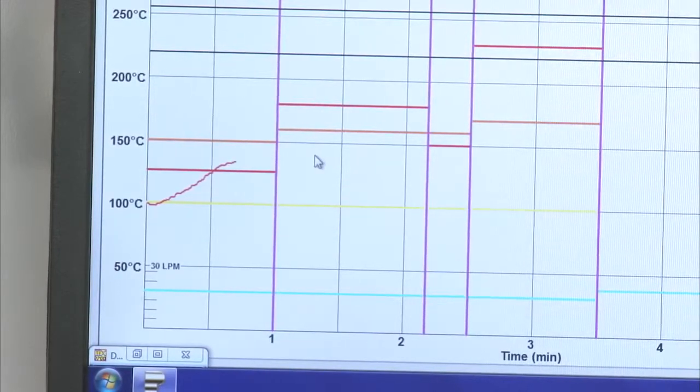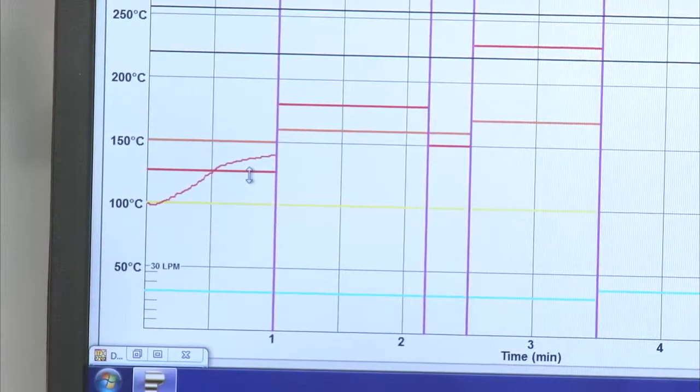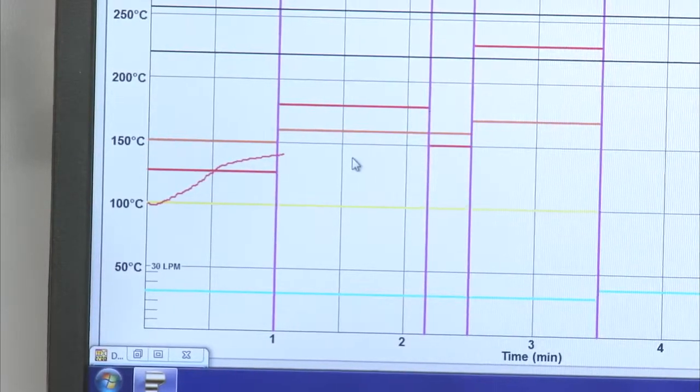Keep in mind, again, we are setting heater temperatures to achieve target temperatures of the board. I'm targeting about 150 degrees C coming out of my preheat cycle. Again, that's going to vary by application. It's leveling off because I set my top heater temperature a lot lower, because we're going to do more work with the bottom heat in our preheat zone. We're just making sure that circuit board gets up to temperature.